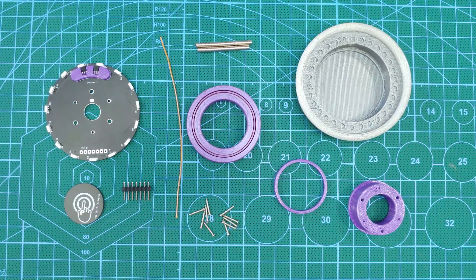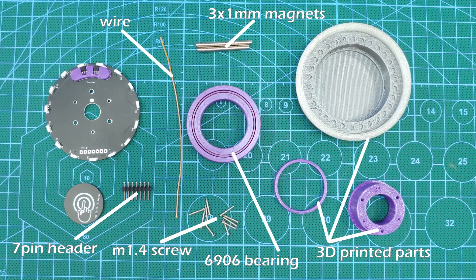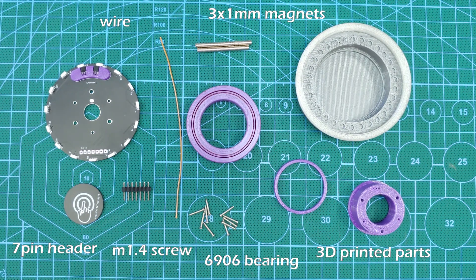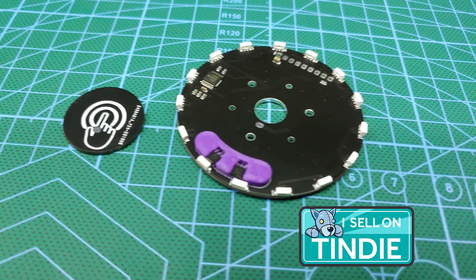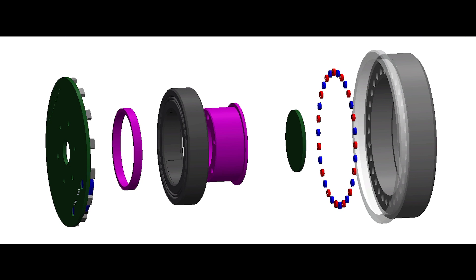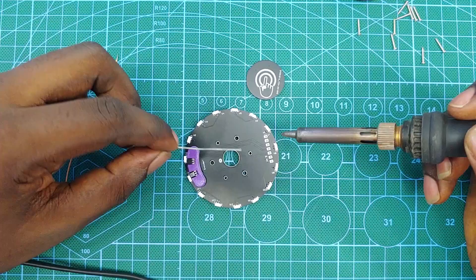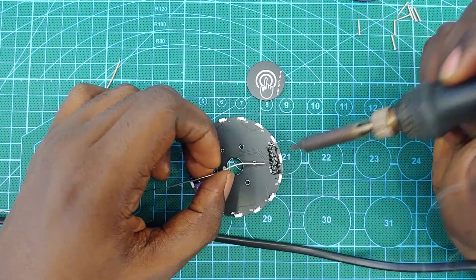Assembling the encoder is also really straightforward. These are all the parts required: a few 3D printed parts, 3x1mm neodymium magnets, M1.4x8 self-tapping screws, a 6906 bearing, a single wire, and a 7-pin header. You will also need the encoder board and the capacitive touchpad, both of which you can get from my Tindie store — I'll link to it in the description. You don't have to buy the boards if you don't want to; so long as you understand the system well enough, you can easily design your own. Here's a quick clip of the assembly process, and I'll also link to the full instructions in the description.